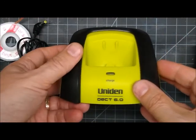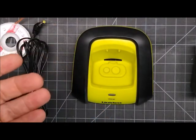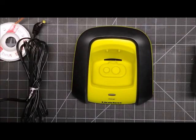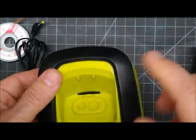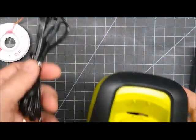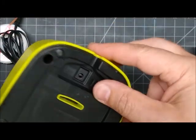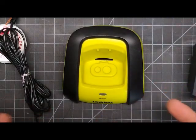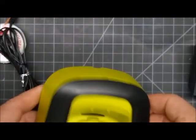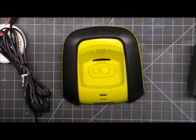And that's how to fix that. When you're done, put your phone in — it should light up the display even with a pretty dead battery after a few minutes. The charger stand should not get overly hot. If it does, you might have a bad power adapter after the repair. But usually it only heats up when that capacitor is bad. Make sure it's charging — don't put it in and walk away and come back tomorrow. Keep an eye on it, make sure nothing's getting too hot and that it's actually charging your phone. Thanks for watching.